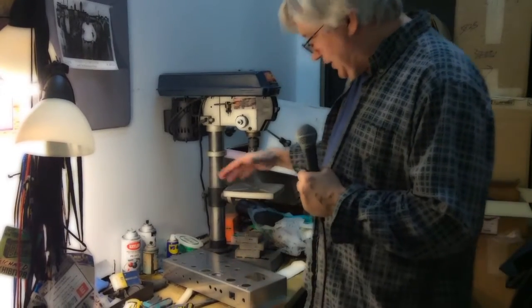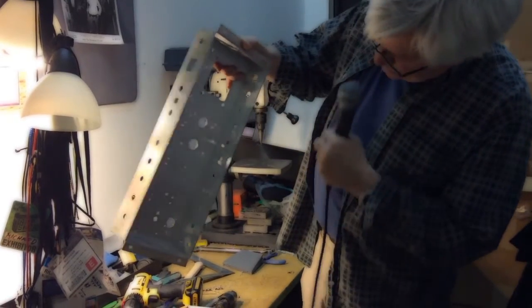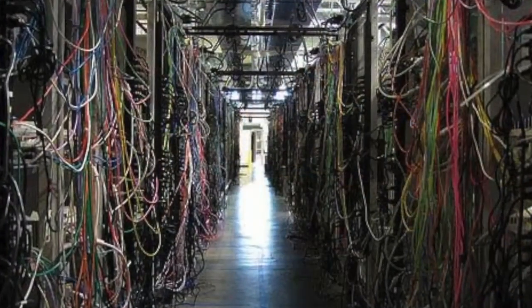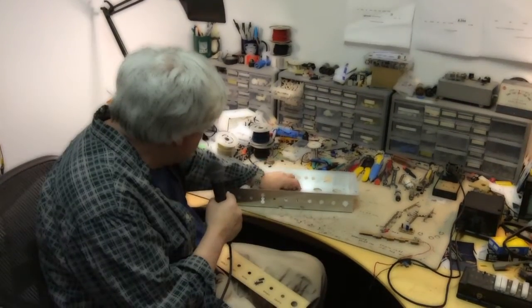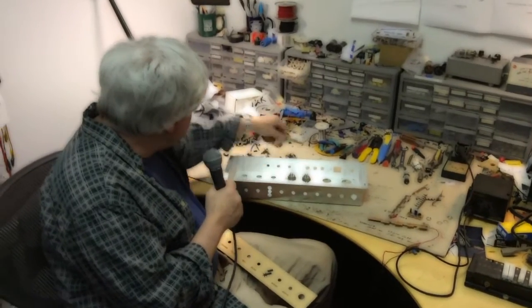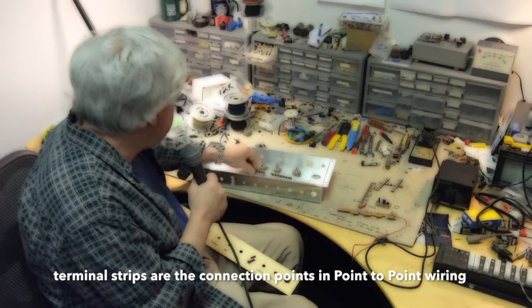And that's the whole industry right here as far as getting your hands dirty. From here we take this, and it's ready to go to what we affectionately call the bench. You hold it up to the light and you can see all the holes in there, and so we begin screwing parts into it. The bench is kind of sort of where everything happens. The first thing we do is we put in the sockets — the large ones and the small ones. There are a few other bits before we put in the transformers. Terminal strips go in like this, and so on and so forth.